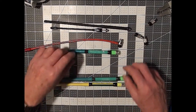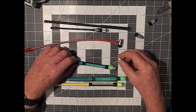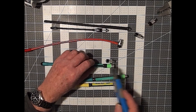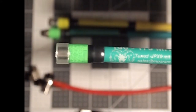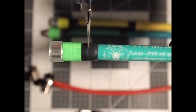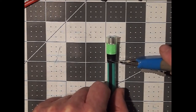The process for that is going to be to circumcise the point where that connection is made. You can see by putting this one down here that connection — you can just see a line right there underneath the heat shrink tubing. Here's a closer look to try and get a better view of where that line is, and you can just see it right under there where the tip of my X-Acto knife is. It's a matter of taking your X-Acto knife and making a cut right through the heat shrink material down to where that line is.